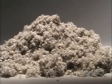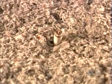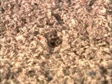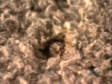Like other insulation materials, cellulose fiber has to meet strict government safety standards. One fire safety test assesses what's called smolder resistance. The company lab weighs a sample from the production line, then inserts a lit cigarette in it. Once the cigarette burns out, which takes an hour or two, the lab weighs the sample again. The weight loss must be less than 15%.